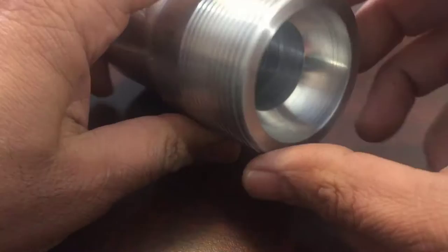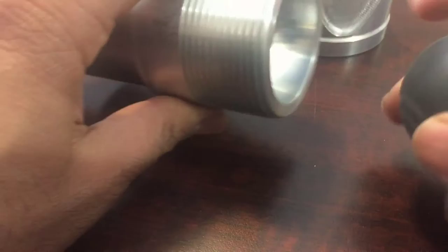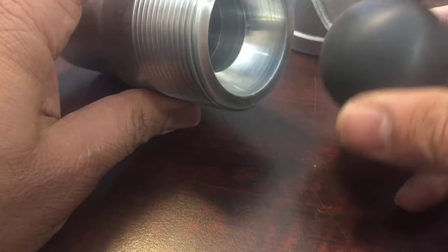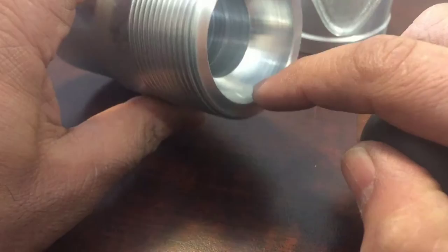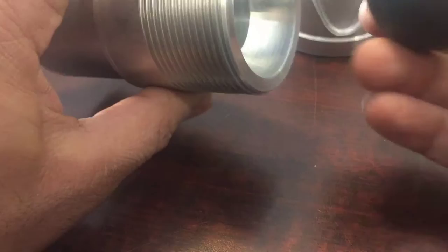What I did was take one aluminum piece and machine that exact same radius — the one you have on the ball — as a perfect internal radius on that aluminum piece. For example, if it's a two-inch ball, you make a one-inch radius inside. You don't have to go all the way to center — let's say about half an inch deep — so you have a one-inch radius cavity inside.